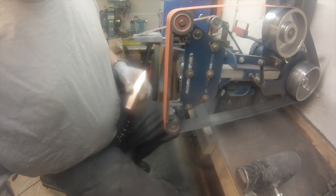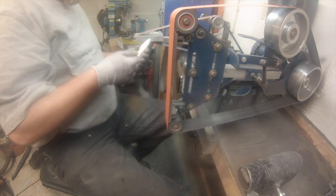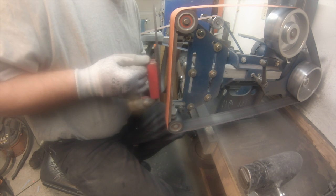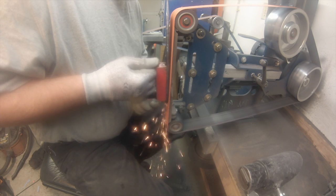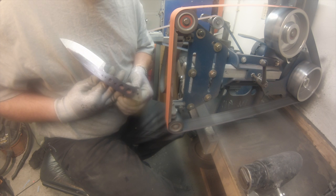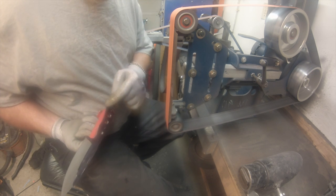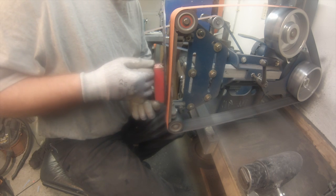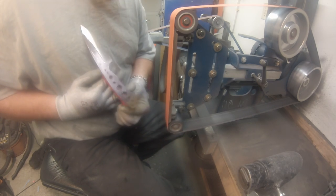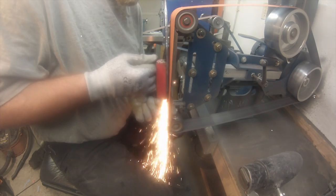It's always fun. So I'm going to turn it to the side here. And you can see that gets a better angle on the belly. I taper it just by bringing the butt end in. Takes a steady hand. You can see as I grind, that black comes off. And that helps me keep my line climbing up even. If it starts climbing higher on one side than the other, I add a little more pressure. So see how it's kind of climbing straight up.